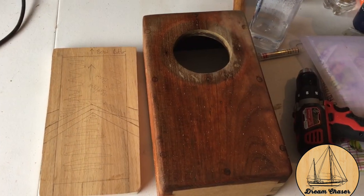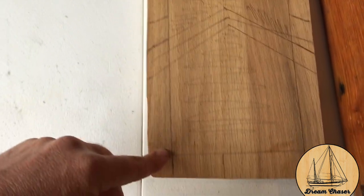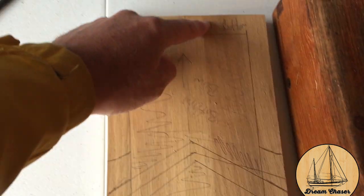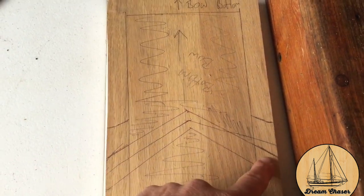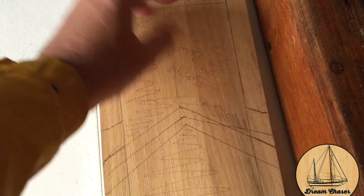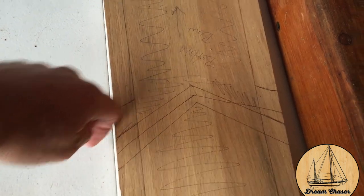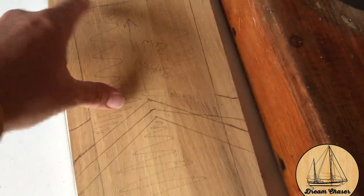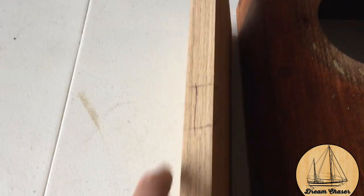So instead of cutting this frame by small strips, what I'm going to do is make this piece to fit in tightly under the Dorado box. You can see here I've drawn basically an outer frame all the way around the inside — that's going to be the frame that mounts to the deck. I'm also doing a V-shaped baffle right here. The thought is if water comes into that front cowl vent, it'll run down the sides, and we'll etch out a little bit so that it can run out the sides and then out the back as well. I'm going to take these sections and cut them out, then use the router and shave just enough off the bottom to go out the weep hole on the side.